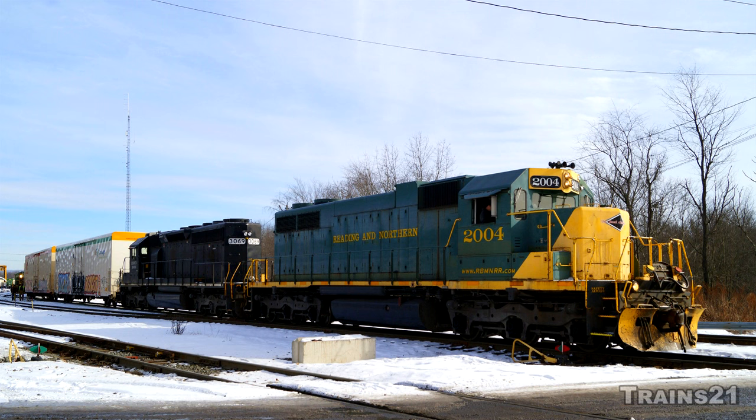The SD38-2 and the SD40-2 were very similar externally, with their relatively long frame and short hood resulting in large porches at either end. The SD38-2 had two radiator fans and two exhaust stacks, while the SD40-2 had three radiator fans and a single turbocharger exhaust stack that was changed to a flat silencer housing on later units. The SD38 used a 2,000 horsepower, roots-blown engine that replaced the SD28. The SD38 initially used a DC generator, but later the SD38 AC used the same AR-10 alternator as the